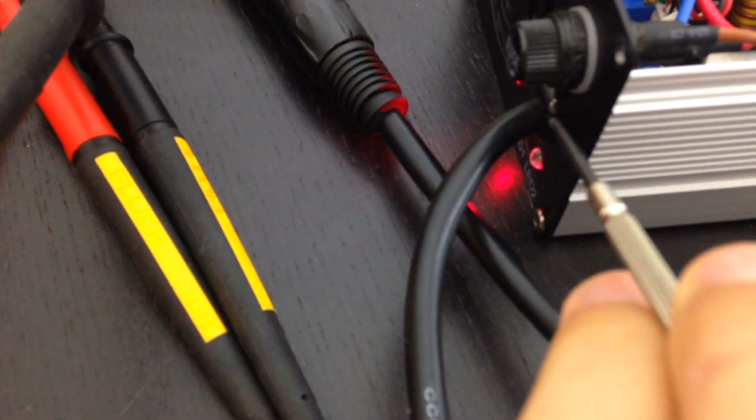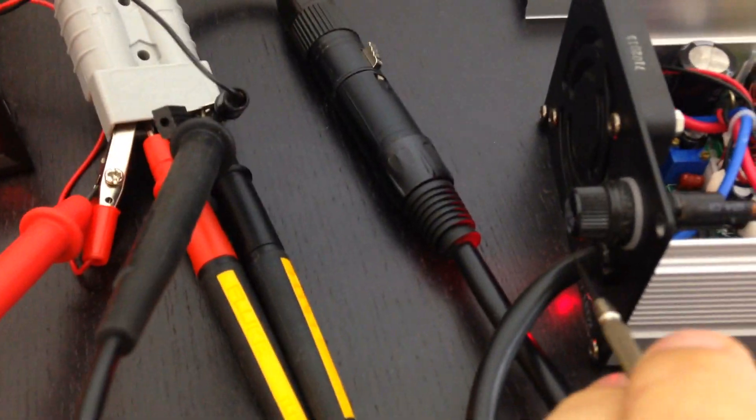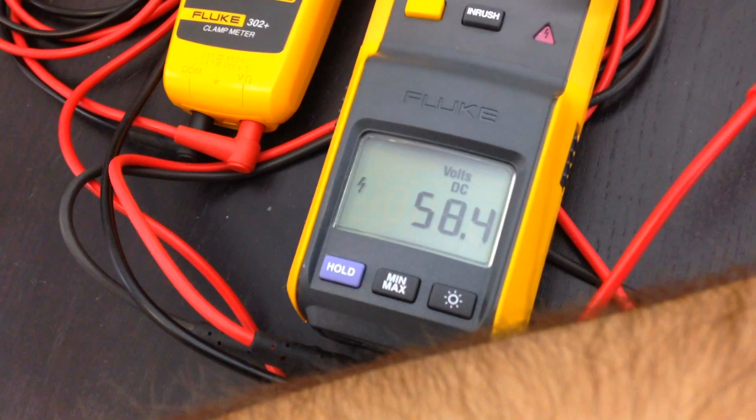That's not the one you'll be touching — do not do anything to those ones. You'll be locating the one that in 99% of cases is the one closest to the wire that connects to your battery. So you're going to look at where this wire goes — there's another trimmer pot there. You're going to turn it slowly, slowly, and check the voltage you're getting.